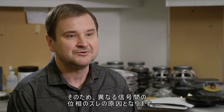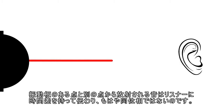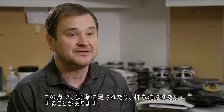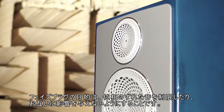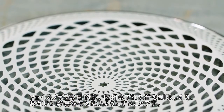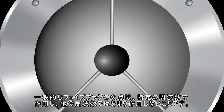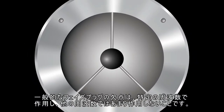So that can contribute to phase misalignment between different signals. What you'll have is sound from one side of the diaphragm reaching the listener at one point, and the sound from another side reaching the listener at a later point. So those two sounds are no longer in phase — they may actually add or subtract. The purpose of a phase plug is to limit the sounds that are out of phase or stop them from affecting each other. The disadvantage of an ordinary phase plug is that it acts well at certain frequencies and not so well at other frequencies.